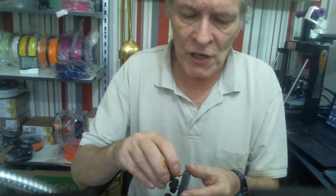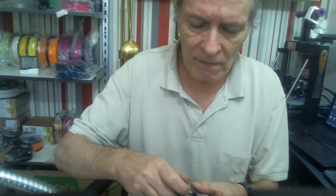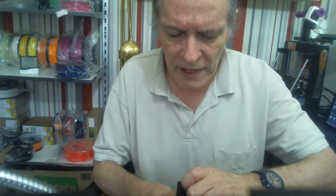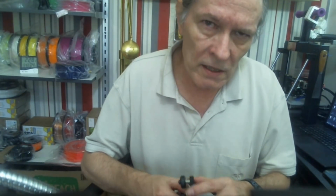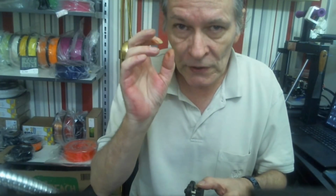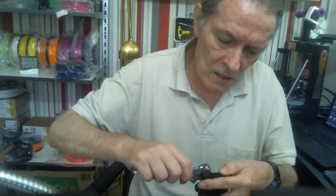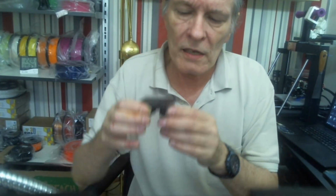You know, that's really strange. When you see, let's say, the Creality CR10 or E10 from Anet or whatever, the screws underneath with a sixcant are normally made so that you can turn them a bit and tighten up the wheel to the rail. That is not the case here with Wanhao. I'm going to put this more on and I'll show you what I mean. All you have to do is just tighten these up normally if you want to tighten the wheels to your bed.